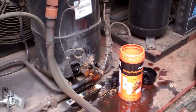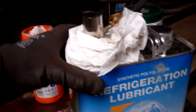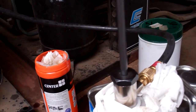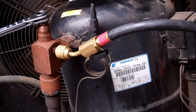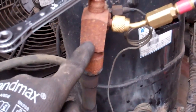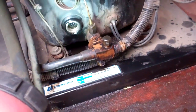I think that's got most of it out. I've got our oil can set up on the hand pump. I've got the suction valve shut so it's got to go in and then drop into the sump — if that was open it could run down here. Let me just pump a bit in there and then keep an eye on the level with the torch.